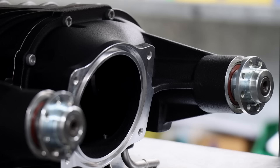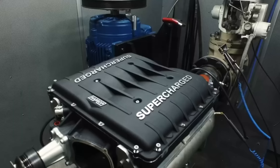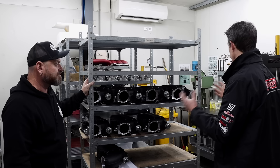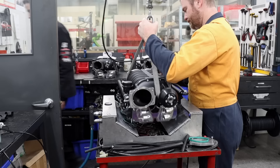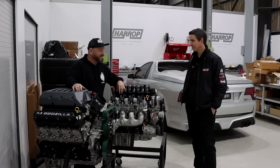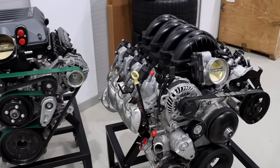So we're in one of the assembly rooms. After the castings have been precision machined, they come in here for assembly. Tang puts together these — what we call the head unit — the main air pump module, and every one of these gets 100% tested next door. They're serial numbered; these ones are for LS, these might be for Tundra or RAM. Then the actual kitting happens next door with Steve — lower manifolds, leak testing, injectors, rails, O-rings — and then we box them up.